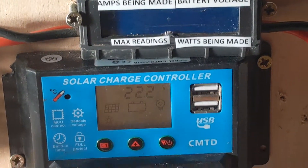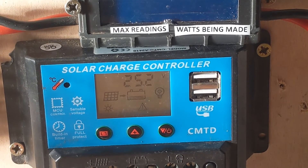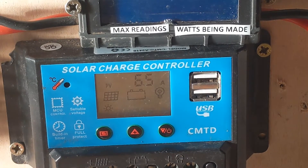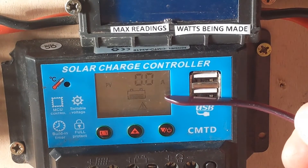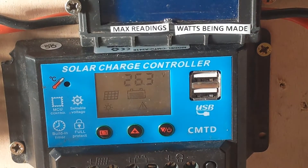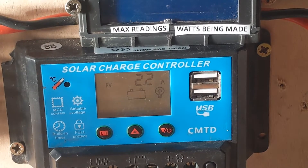I've blown my meter so I'm just going to show you this thing in operation. I managed to get it working again — it seems to be working automatically. The wind is howling so it's probably going to go into over mode in a minute. This is the amps the turbine is putting in at 24 volts. When this light stays on solid, that means the dump load is in operation. Flashing means the dump load is waiting to come on. You can see we're getting quite a bit of juice in from the turbine.